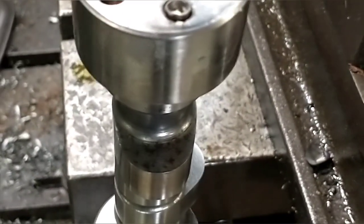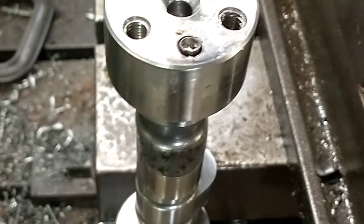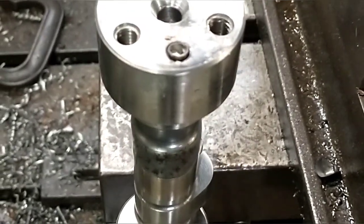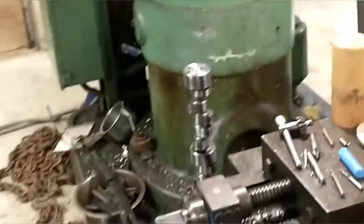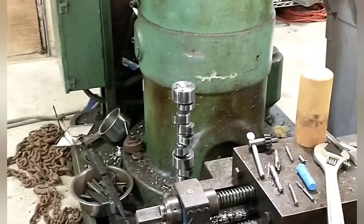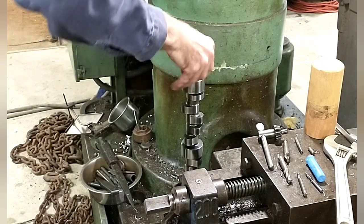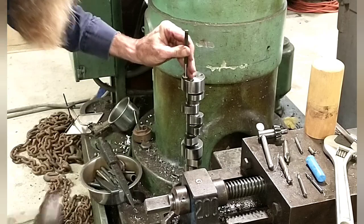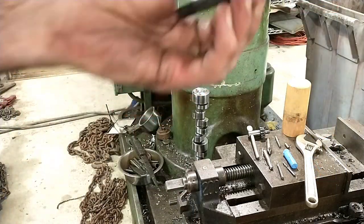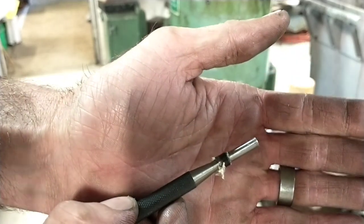See, it's sticking up a little bit now. I changed my mind - I was going to use grease, but this is a pretty sloppy hole and I remember an old-timer telling me once that the cheapest white bread you could get, all wadded up, actually worked better. So we've got our hunk of bread, and he wasn't lying. I don't think I'd have got this one with grease - my hole was too sloppy. One dowel pin popped out with Wonder Bread!